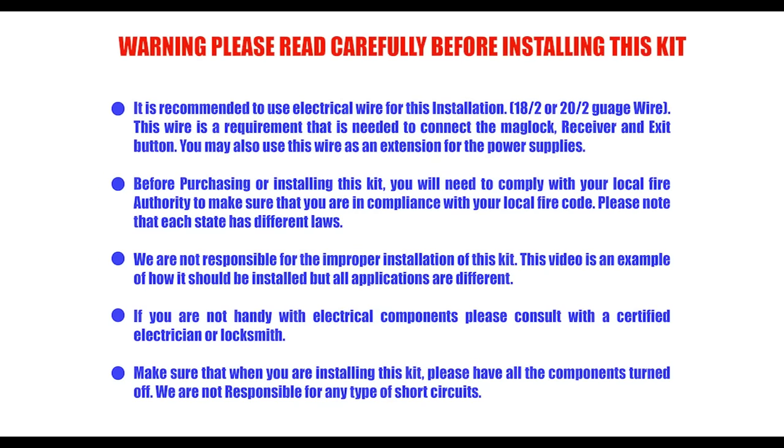Warning, please read carefully. It is recommended to use electrical wire for this installation. 18/2 or 20/2 gauge wire would be sufficient. This wire is a requirement that is needed to connect the maglock, receiver, and exit button. You may also use this wire as an extension for the power supplies.